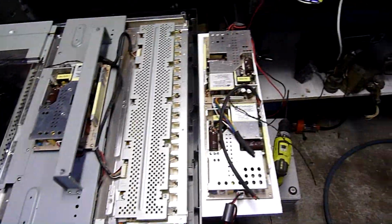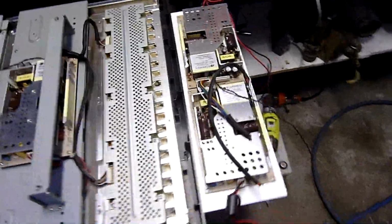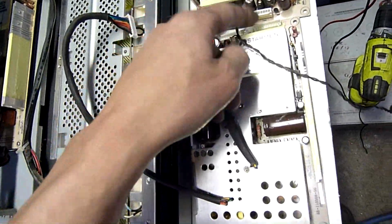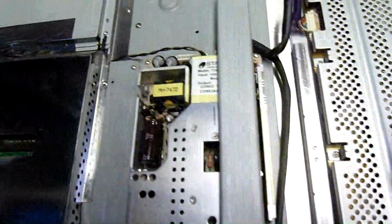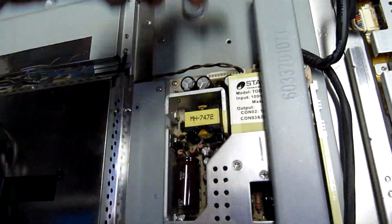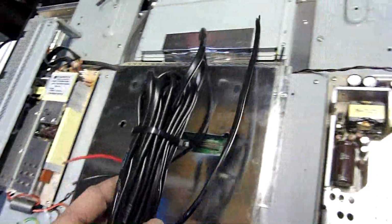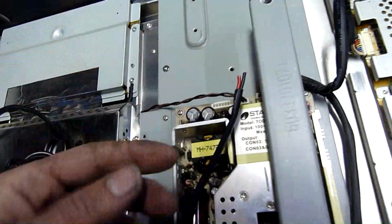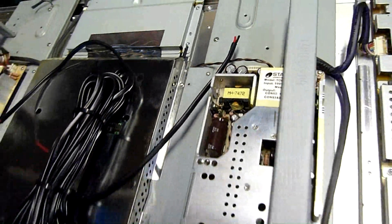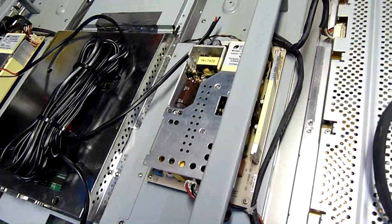Okay, so the good news is I still have the power supplies from the other one that I scrapped, the 40 inch. So I've got an extra cable that... Oh no, it's not that one. I do have the other one. I unplugged it back when they were on the shelf because they're all still tied to the harness from the TV. But essentially all I'm going to do is pop the proper header in here and just branch off and pinch 12 volts off that, because that's completely unloaded. That's only a power on command. The rest of that 12 volt side's just been sitting running unloaded the whole time, so I'll just put a meter across it and make sure it's healthy, maybe do a bit of load testing on it just to make sure it's still alright, and then change it out.